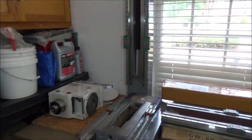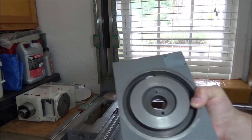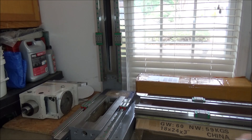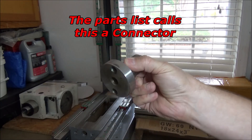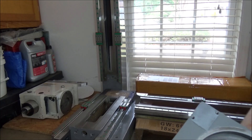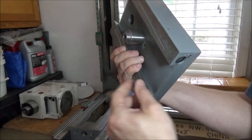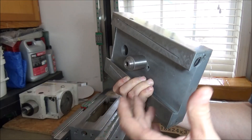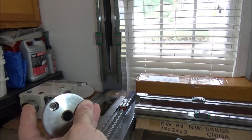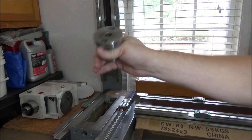The way I'm going to go about the saddle for the Z-axis is I'm just going to basically copy what I already have. This is the steel saddle. The way this worked was it had this bung or pin that slid in like so, it had these two fasteners right there, and then on the back side this would hook to your ball screw mechanism. What I'm going to do is remachine into my new saddle a pocket like this, reuse this piece, and do away with this other piece.